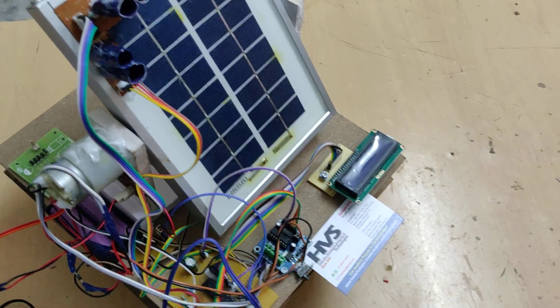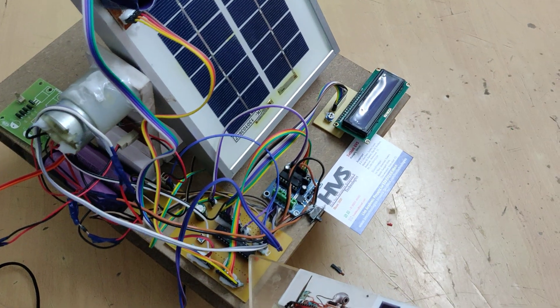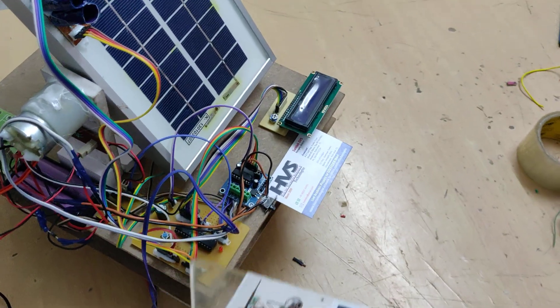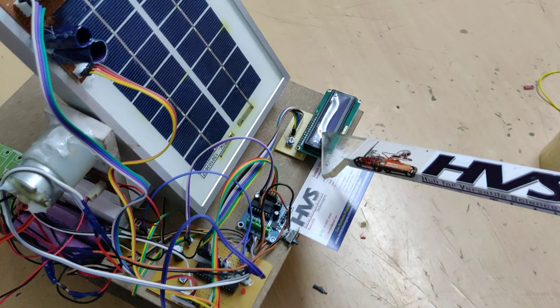South deviation during the winter season will be achieved by this PIC16F72/73 microcontroller, which takes input from four LDRs connected to pins A0, A1, A2, and A3. It also continuously measures the voltage from the solar panel.